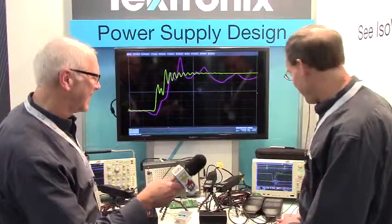Hi, I'm Richard Booman. Hi, and I'm Mike Mindy, and we're at PCIM in Nuremberg, Germany showing off the new Tektronix ISOVUE system. Our demo here is showing a typical half bridge measurement, measuring the high side VGS and the low side VGS measurement at the same time.